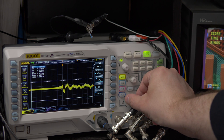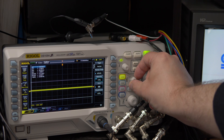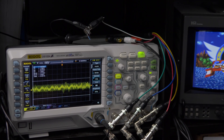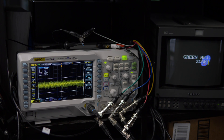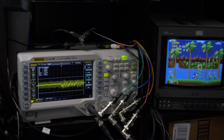You can see the spikes persist on the screen showing the likely maximum voltage, so let's try to get this centered. After it's centered, move the trigger to the center of the signal as best you can. The moment you change a setting or re-center the image, you'll clear the screen of any persistent data, so make sure to center everything before you're ready to measure.